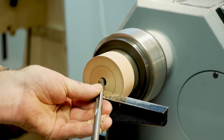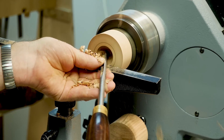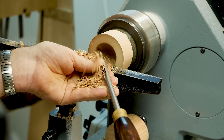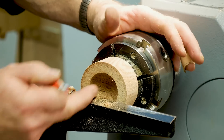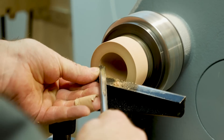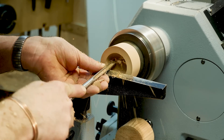So quarter inch — work from the centre out. We've got the flute right over at nine o'clock. This is quicker — removes that material very fast. We're after a half round shape, almost like an egg cut. Now we're doing the back cut; it won't give us a good finish, so we need to clean this up. We're going to turn the gouge over, flute about two o'clock, work from the rim downwards. Test the bevel angle, then drive the tip round. Still not too bad a finish.